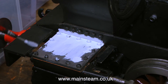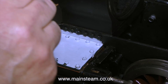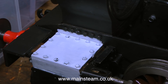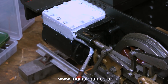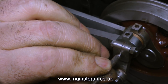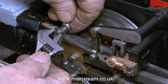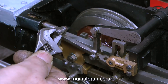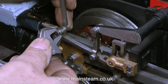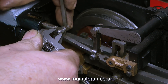Now it's time for a very small amount of painting. I thought for a change I would paint the top of the steam chests this nice light grey — it looks very attractive, not dissimilar to the colour of my beard. This is special etching primer and it's really good stuff. I'll be doing a feature on the paint that the Steam Workshop uses very shortly. Now I have the return crank in what I consider to be the correct position, I'm making a very small centre punch mark so if I ever remove it I can put it back in the same place. All I need to do now is refit this nut onto the pin that holds the combination lever to the valve spindle — and guess what, my normal spanner wouldn't fit it. But guess which spanner fitted it perfectly. I rest my case.